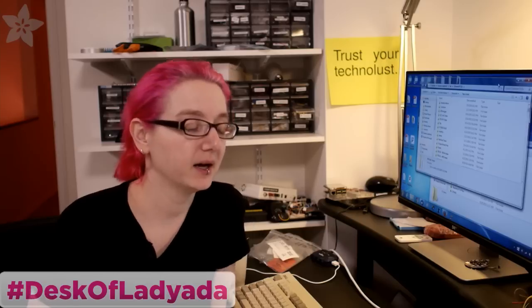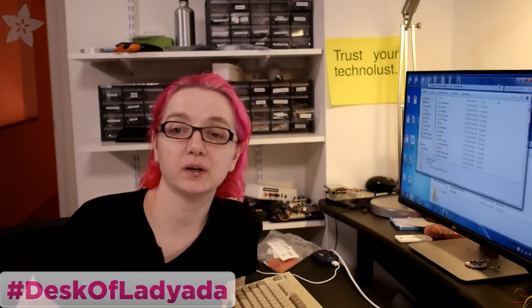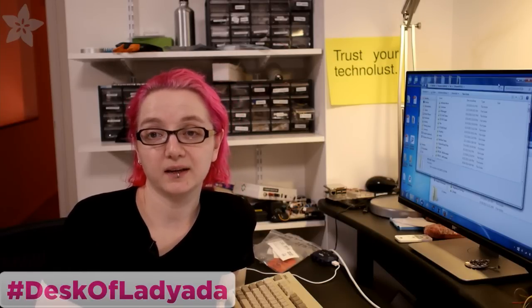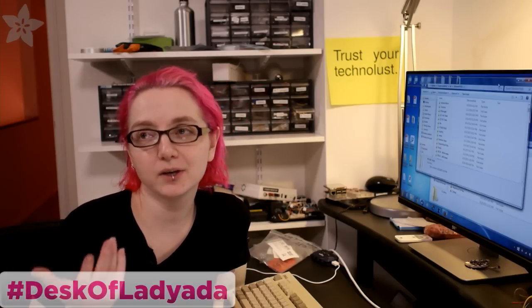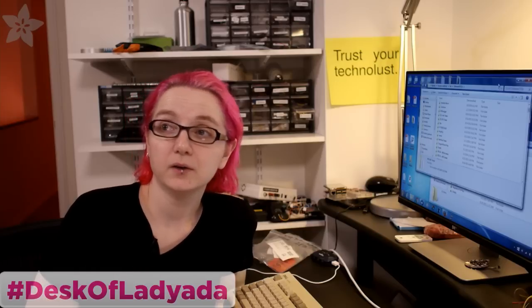On Monday. But basically, every time we design a board, we have to design a tester for it. And that tester will check all the elements of the PCB and basically beep and turn on an LED if it passes. We get 99 or 100% yield on almost all boards, but it's still good just to test. You never know. Especially doing a first article inspection, it's always wise. And if you can do the test in under 10 seconds, then it's definitely worth testing each board, I think. So let's get right to it.